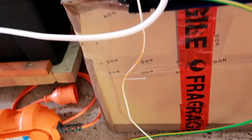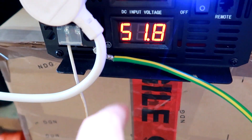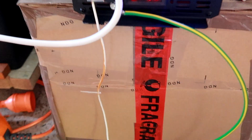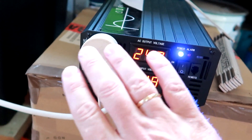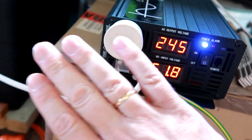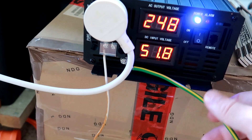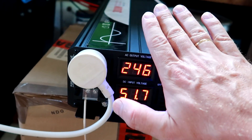I've ordered another inverter because I'm not happy with the current cable situation — having one of the AC legs connected to earth. The manufacturer couldn't give me information about this, but I need that link for my Tesla charger. The inverter itself is totally safe with floating 240V; you just need to ground the inverter, which grounds all outputs. Nothing wrong with it at all.